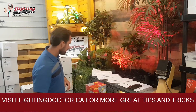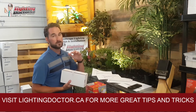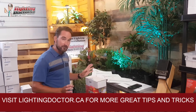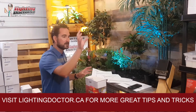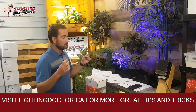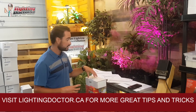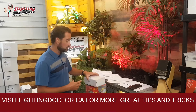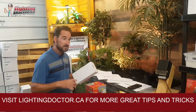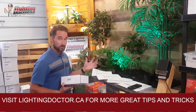If you're just going to use some up lights to highlight some of the architectural features and trees, focusing in on one or two areas of the house instead of trying to light everything, you're better off saying: I'm going to focus on this area and make it look just perfect, and then add on later if I want. So he went from about 40 lights down to about 20. We scrapped all the path lights at this time because you get way more bang for his buck with the accent lights we're sending him.